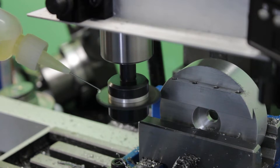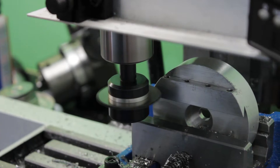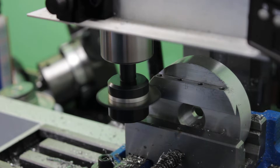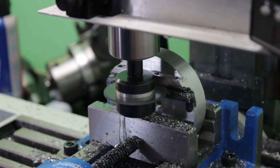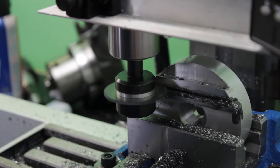The next step is to machine a narrow slot that will have the same depth as the dovetail and that will end very close to its bottom edge. This will allow for this side of the dovetail to be flexible just enough to be able to move it with the four set screws. This is a very simple and reliable way to lock the sliding plate.